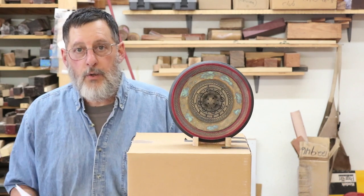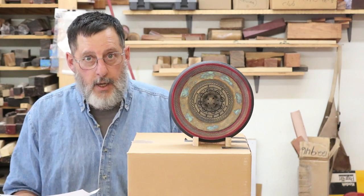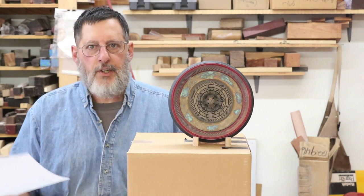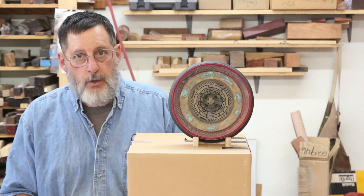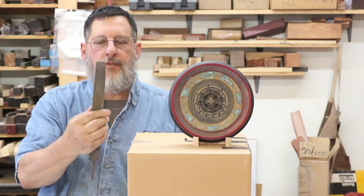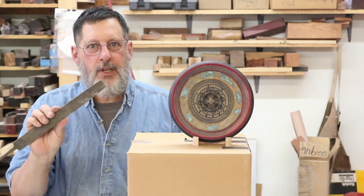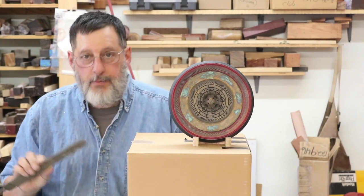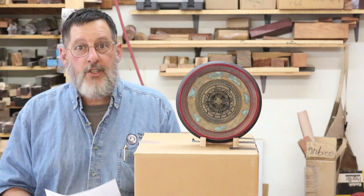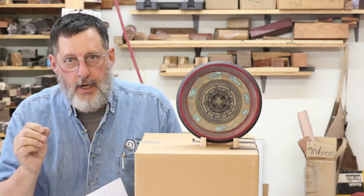The tool steel we use in woodworking and woodturning has a certain hardness. I'm not going to talk about tool steel as it's usually presented in woodworking catalogs — there are dozens and dozens of alloys used in tools. There's a file, which has a very high carbon content — that's an alloy. It's not just pure steel; it's a lot of carbon, which makes it really hard and brittle. When we talk about the Rockwell Hardness Scale, it's Scale C used for steel.